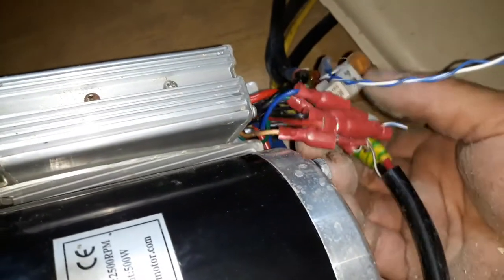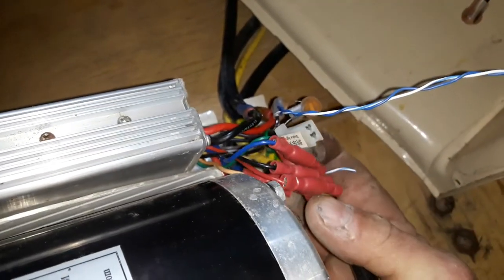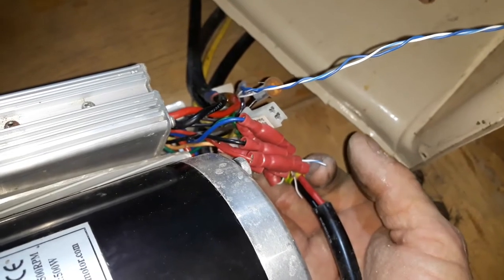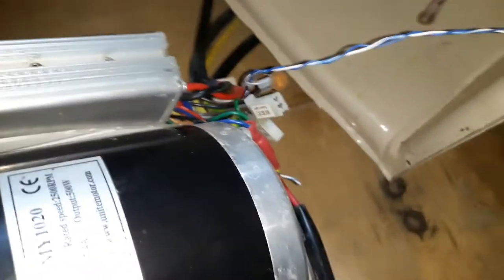There are lots of wires here. It's a bit hard to explain, but basically the throttle controller takes zero to five volts. Five volts is full throttle. On these, zero is zero throttle. So anywhere between zero and five gives you a proportional ratio of your throttle.